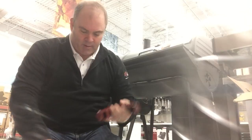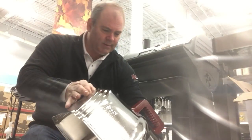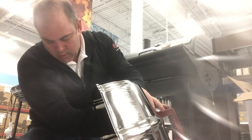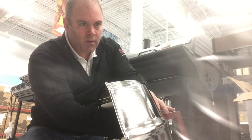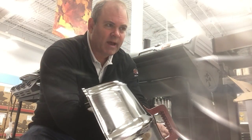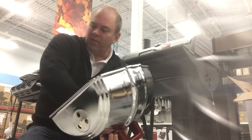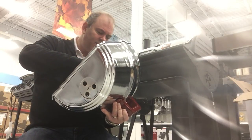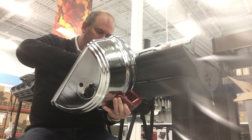Top, fairly simple. Take our top handle, again, 2 bolts. Put those on both sides. I like to tighten one bolt first by just loosely putting the washer over that bolt, and then finger tightening the nut. We like to tighten these nuts and bolts a little at a time on each side, so we don't have the handle crooked, or we're taking too much pressure on one side of the handle than the other. So this one, unlike the bottom handles, just tighten so you get a good feel, good tightness on there. Go to the other one, tighten that one down, and then go back again and give another 1 or 2 turns to each side.